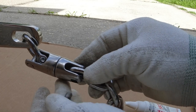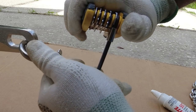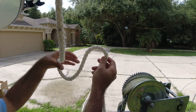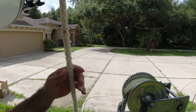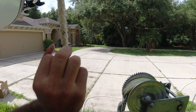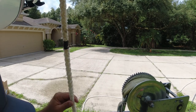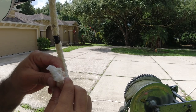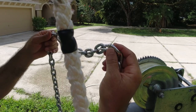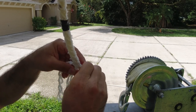Now I can connect the chain here — all set. This is also going to add more weight to the chain. I've discarded a lot of rope that was worn out, and from this point on the rope looks pretty good. The windlass can do some damage to the rope sometimes. This part right here is fine, it's newer, but this section gets used a lot so I'm going to cut it here. Before I cut it, I'm going to place some tape up here so the rope doesn't unwind. Now I need to untwine all this rope — it all has to go through the windlass with the chain, and it cannot have any shackles because it'll damage the windlass.